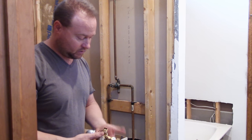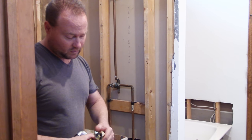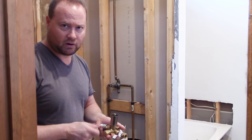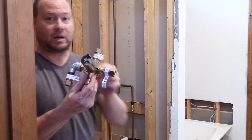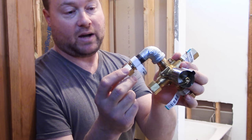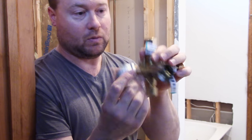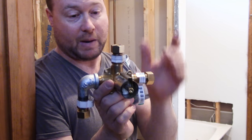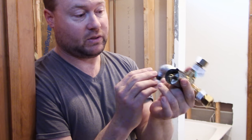And since you're probably not a professional watching this video, it's a lot easier to use compression fittings and galvanized fittings and screw it together than it is to solder inside a wall that's already been built on pipes that have water in them. So this is what I come up with: because one side is tight, I've got a street elbow and galvanized going into a brass compression fitting. Here's the cap they gave us — any half-inch cap will work, whether galvanized or brass. Here is another compression fitting going on there and a compression fitting going up. So we're going to mark the copper pipes exactly where we need to cut them so that this will just snap almost right into place.